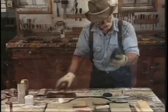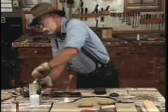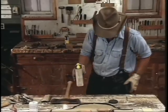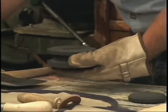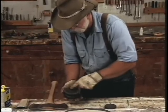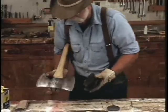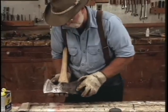After the filing, it's time for the axe stones. Still use your gloves. This is a sharpening oil — Norton, the people that make the stones, also make this honing oil. Put some on the coarse side, let it soak in, rub it around. That makes a really good lubricant. Then what I do is hold it in my hand like this, under my arm — and again, you're working away from the edge but this time in a circular motion with the coarse side.